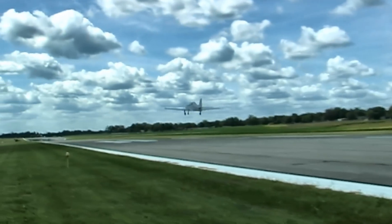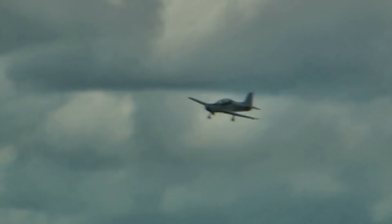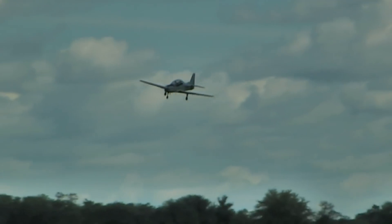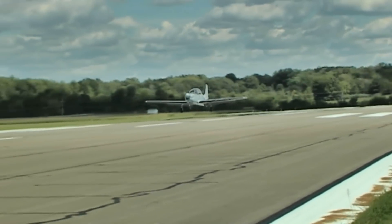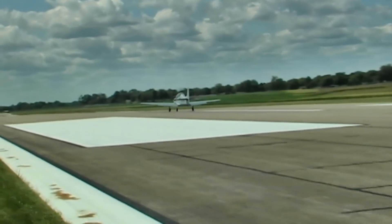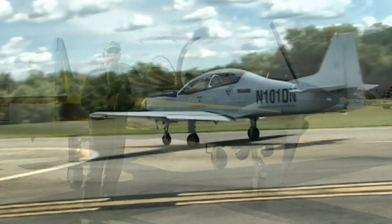Around the pattern, we were at a couple thousand feet. Coming around lined up on landing, I always thought we were a little bit high — which I actually prefer. The airplane is willing to come down; it produces plenty of lift but doesn't have the floating tendency some really light LSAs have near the ground. Speed control isn't quite as critical. The way to make a very lightly loaded LSA land well is to have your speed spot on the money, but this airplane is a little more speed-compliant. We were approaching at about 70 knots today just to give us more decision opportunities given the air show traffic.